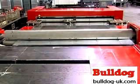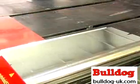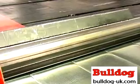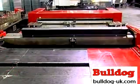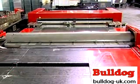After the notch, the blank is fed into the standard combination shear and folder, where flat blanks are produced. Male Pittsburgh locks are formed as well as L, U, or fully wrapped sections of duct. Once again, this is all handled by the user-friendly CNC control.